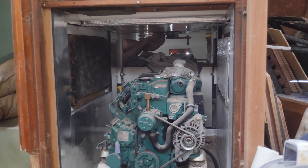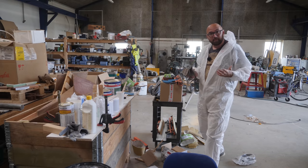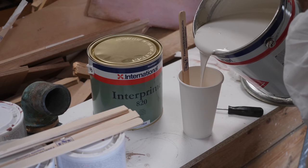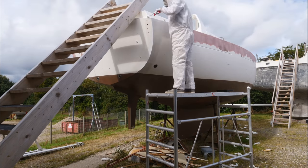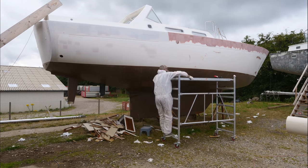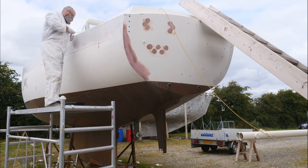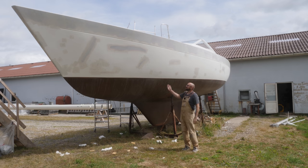Now it is just a matter of getting the bolts tightened down. I've checked the fairing compound on the hull and it seems nice and dry, so I'm going to hurry up and apply the epoxy primer so it will have a chance to cure before it starts raining. And that's it — I am officially done fairing and into the painting stage. I am so freaking excited!